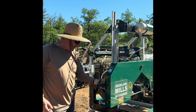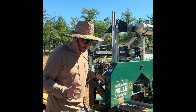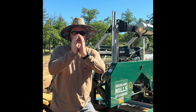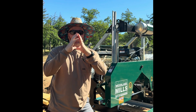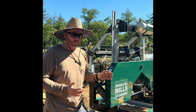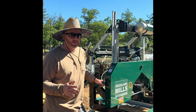And inside your stick here, your tensioning rod, if you want to call it that, are Belleville washers. And if you guys have ever done any kind of mechanical work, you will understand that Belleville washers are not intended to be torqued. They're kind of a concaved washer like this, and as you push, they straighten out. So very minimal contact surface on them. It's all based off of the tension of that washer, basically acting almost like a spring. And there's a stack of them in there, right? So getting consistent torque with a torque wrench, I don't care how high end of a torque wrench you have, is going to be very, very difficult.